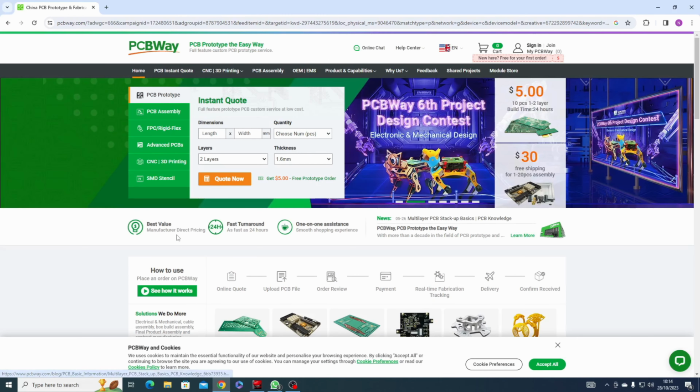Try and do it this way so you can see on the camera. So you can see now that's all full, and that'll be ready to lift off in a minute. Sorted. We should be able to take this off like so, and you will see that all the pads have solder on them. Which is great.